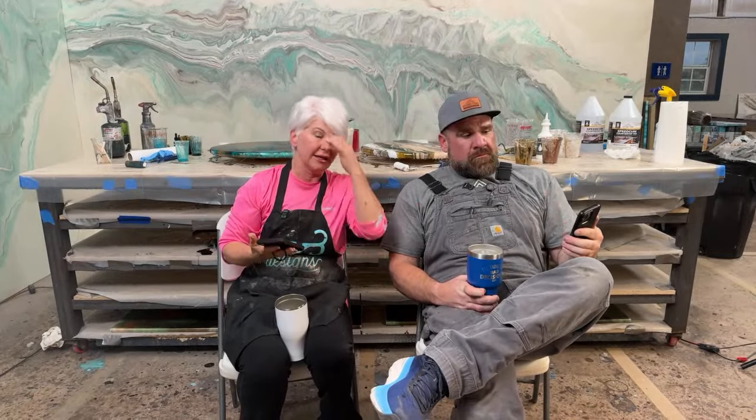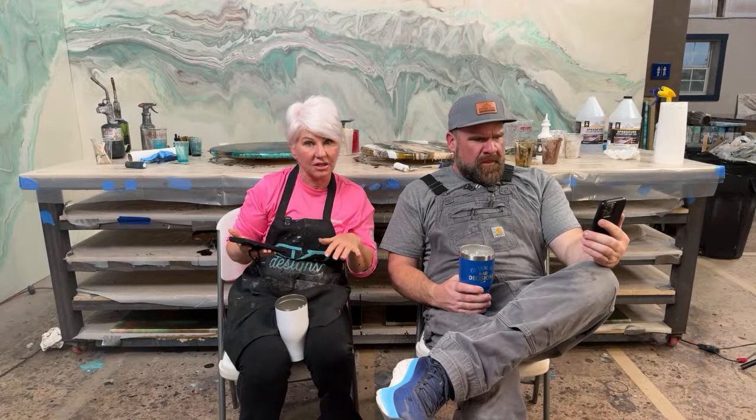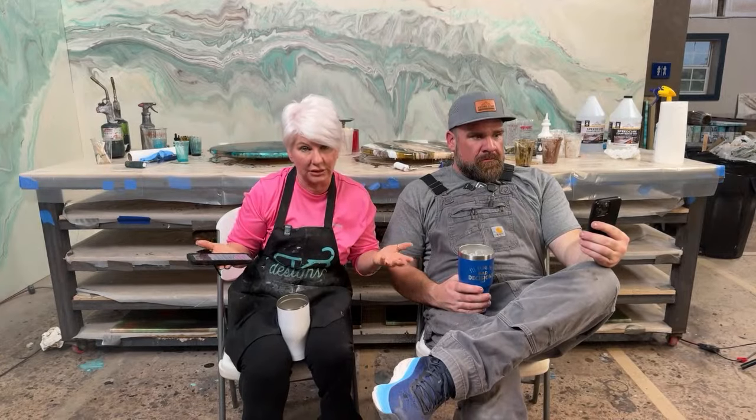Because the product is so incredibly thick, you technically don't need a flood coat. Correct. But if you are going to put UTC on and you're not really confident in your UTC application method, we have several videos that explain the UTC, guys. If you're not doing sample boards with your UTC and you're not confident, I personally would put a clear flood coat, because now you've got a buffer between your color coat and your UTC if you have to sand it down. The sanding on the UTC is a booger, because it should be. It's protective. You don't want to be able to take it off easily.